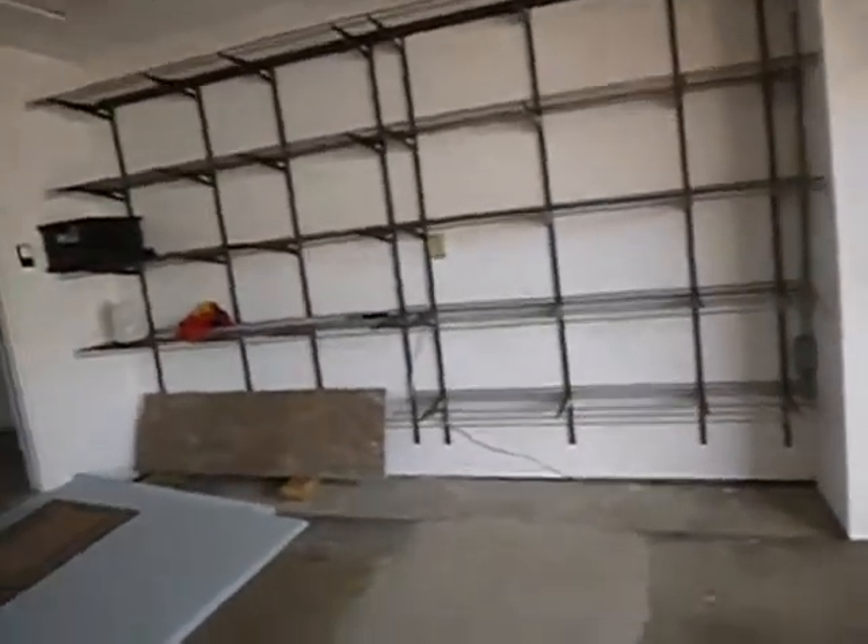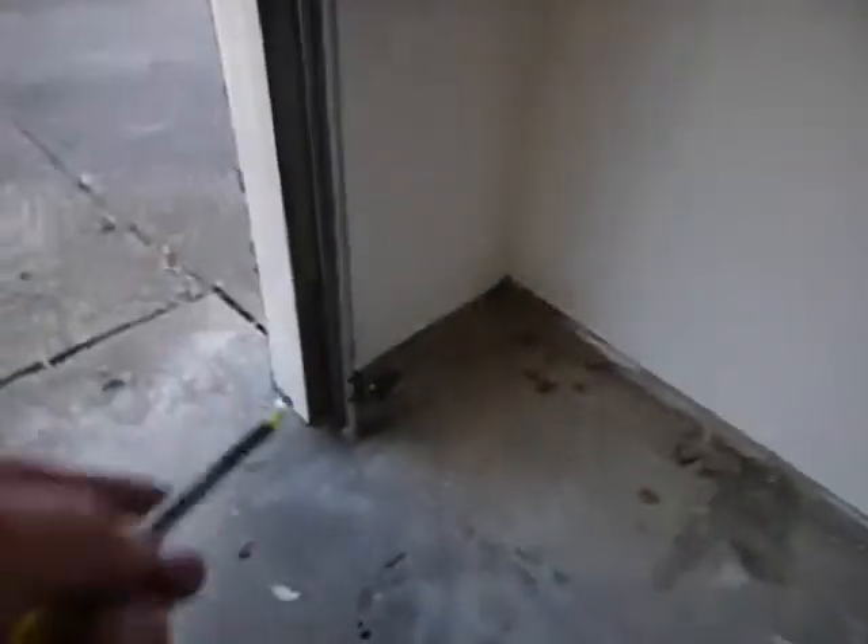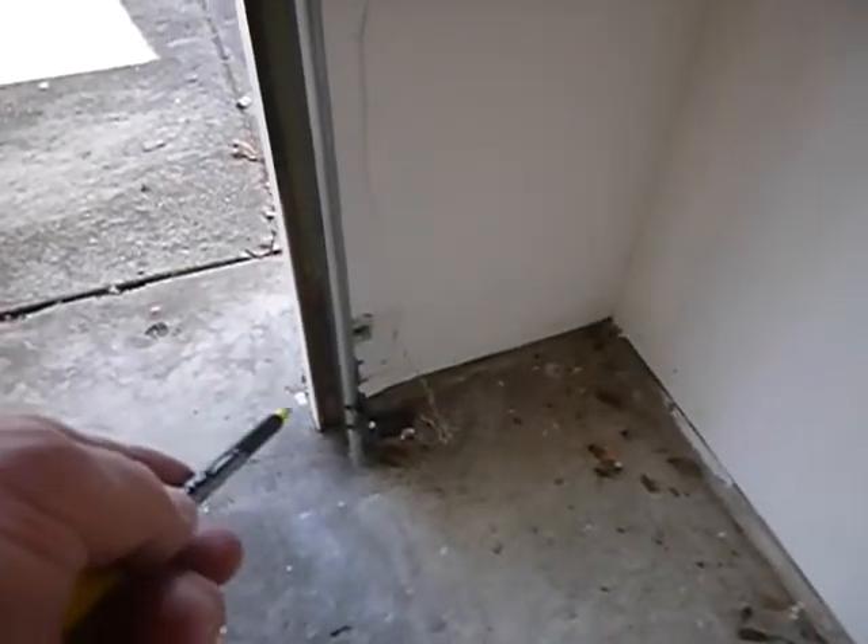So those are all the things that are good with the garage overhead door entry. But I'm just getting started. These optic sensors are just a smidge higher than six inches from the floor — they should be no higher than six inches from the floor.